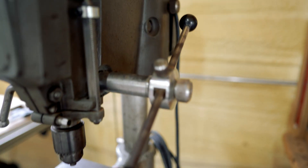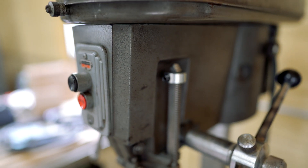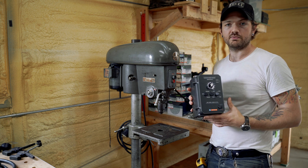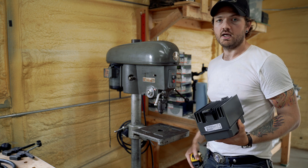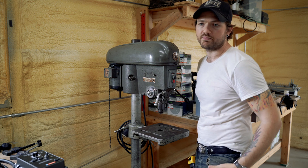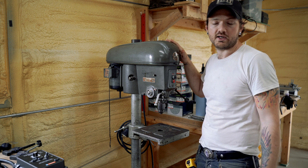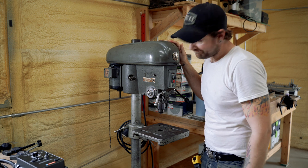It's a sweet piece of machinery. It was missing the depth stop indicator nuts, but I found kind of a solution — a 5/8-inch collar with a stop nut, and I'm going to see how well that works. First things first, I've got to find a place to mount this giant controller. It's about 8 inches by 5 inches, so I've got some scrap steel that I'm going to weld up a nice little bracket and mount it to the back of the motor. I'll eventually also get an LED work light, so I'm going to leave a little extra room on the bracket for that.